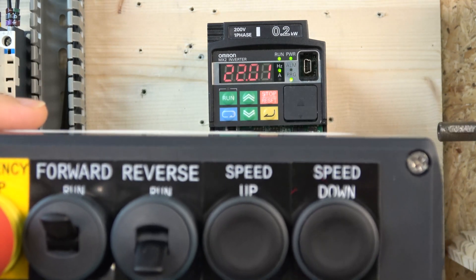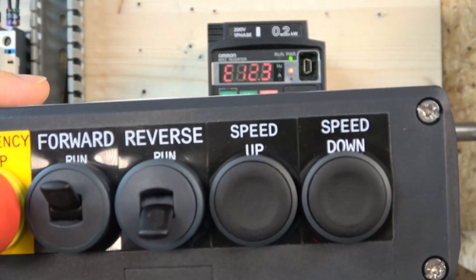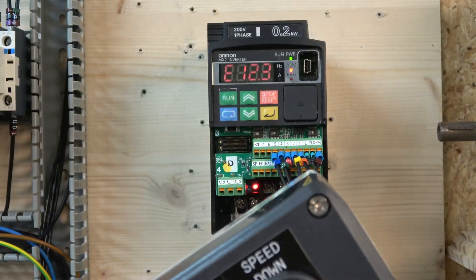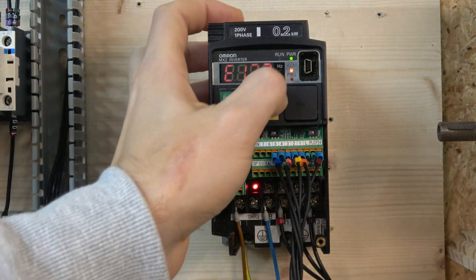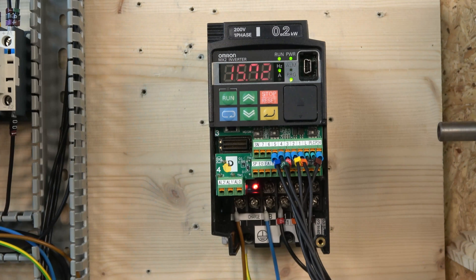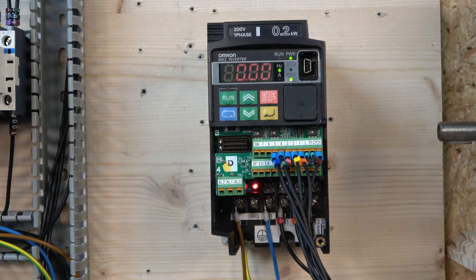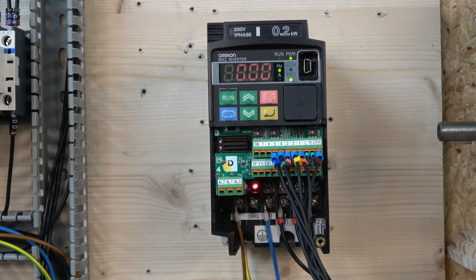We can put it the other way around and it will stop and go the opposite direction. When you click the E-stop it puts it into trip mode. Then you reset it — be aware that once you reset it, it will start to try to go again. Plus, because you have a couple of inputs left over, you can put it on three-wire control if you wish. All these options are still there — you can mix and match.